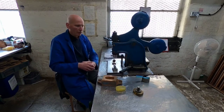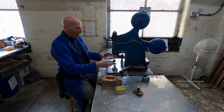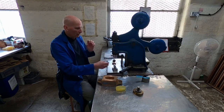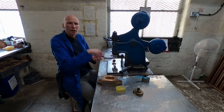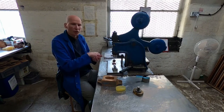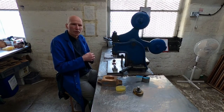The way that the mould is designed is for the collar to hold the soap in place, and a top and bottom die to move up and down. That stamps what we call the billet, or the soap piece, into the final shape — and I'll show you that in a little more detail here.